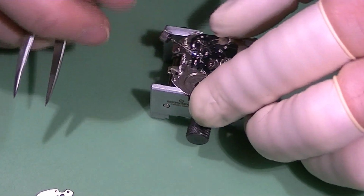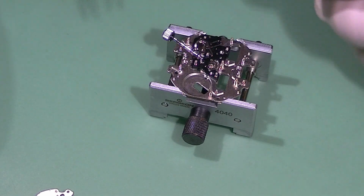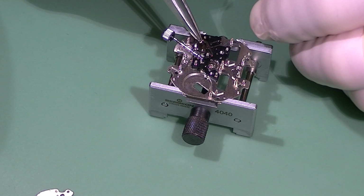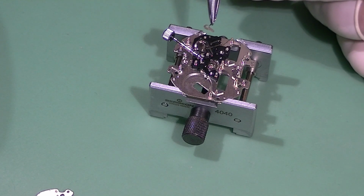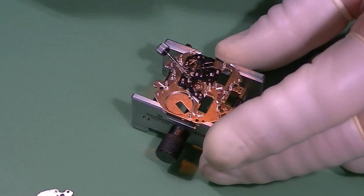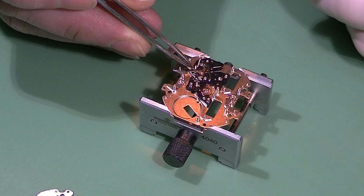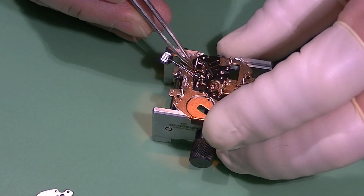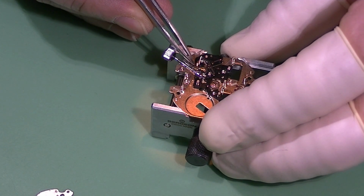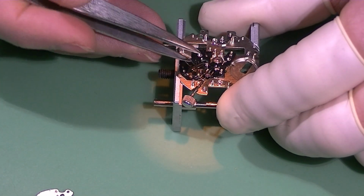There you go. Setting lever installed, and I just want to check if it moves correctly. Now this part, this is the changeover switch lever. This part is what makes really the watch behave as it should when you pull out the crown 1 or 2 clicks, because it has a tip that touches directly the circuit board or PCB, electronic circuit as you wish. So it's directly connected through 2 pins to the setting lever, so when you pull out the crown, the protruding pin just slides under the PCB and touches some electrical pads, and according to its position the watch will behave differently. It's very clever.